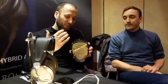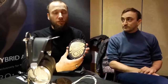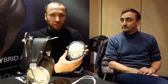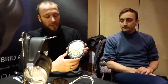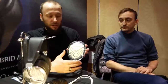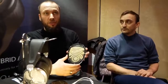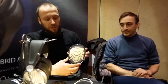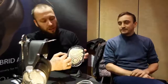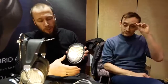Here you can see a demo of the diaphragm. There are several unique and very special features. The first one is the design of the trace pattern on the diaphragm. As you can see, it is a continuous trace but split into two different shapes. It has different efficiency in reproduction of different frequencies — the spiral one is more efficient in reproduction of medium and high frequencies, while the switchback trace is more efficient on reproduction of lower end frequencies.